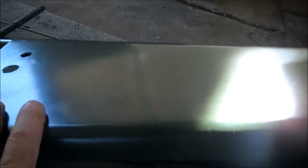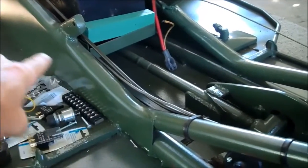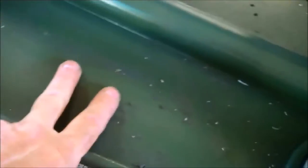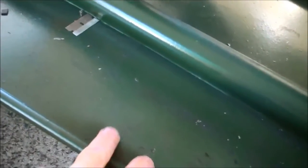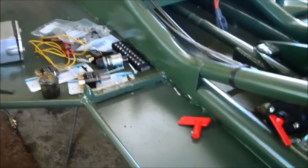You'll need a little bit of sheet metal — not too much. For the dash I use 16-gauge. You don't need a lot — just some pieces enough for the dash and this large plate gusset here, which is also 16-gauge. Then the belly pan itself — if you run a pan, depending on the design in the back and whether you run a full pan, usually a little more than half a sheet, maybe three-quarters of a four-by-eight sheet will do all your sheet metal work there, in 16-gauge.